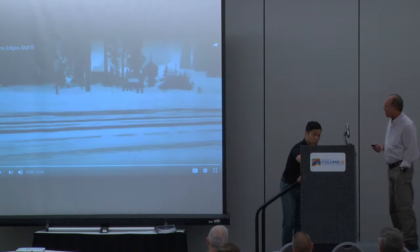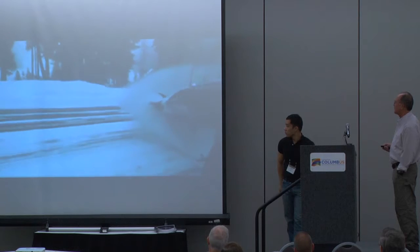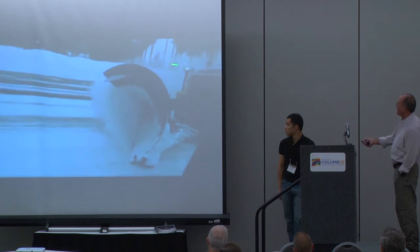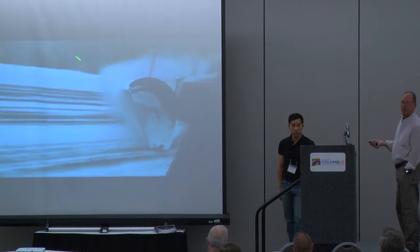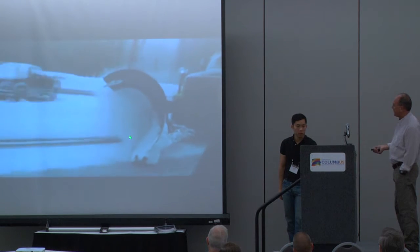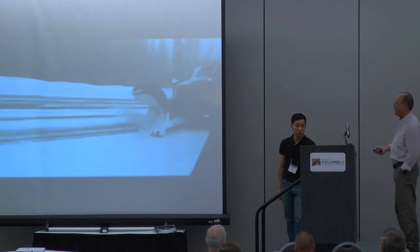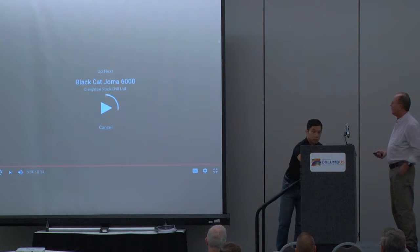Here's another hybrid bit on a plow with a shorter moldboard curl. You can see specifically how it cuts and pushes the snow — it's not getting the scour effect. The snow goes right over the top of the moldboard, right into the windshield. Our operators said this plow is defective and started shelving these plows. But after we hooked up the video and saw this, it's not the plow itself — it's the bits. They're just so efficient and they need to be run almost at a 90-degree angle, pushing the snow instead of rolling it inside the moldboard.